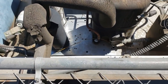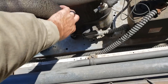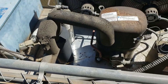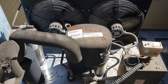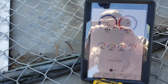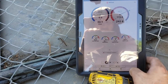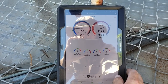For a walk-in freezer, I should see some frost on the suction line and we're not seeing that. Usually you'll see this being frosty and feel a lot colder. So we're going to go ahead and gauge up to see what's going on within the system. The unit is actually cycling off — I have a feeling it's cycling off on temperature because it just satisfied and then turned back on.